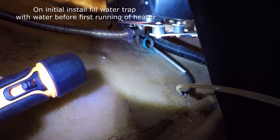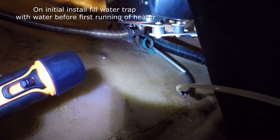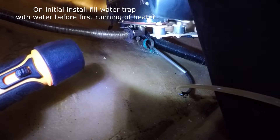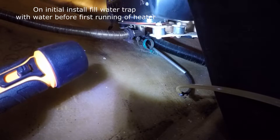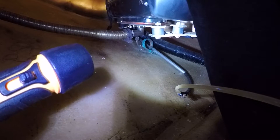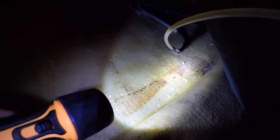This water trap acts just like the water trap under your sink — the S-bend or the toilet — and it stops gases coming back through. The top of the loop of the water trap has to be below the outlet of the gas, so as condensation comes in it remains in the loop and the exhaust gas can't get into the boat. On my boat it just drains down, probably producing about a tablespoon of water each use. I don't worry about it — you could drain it into the bilge or a bottle, but next time it will evaporate out.